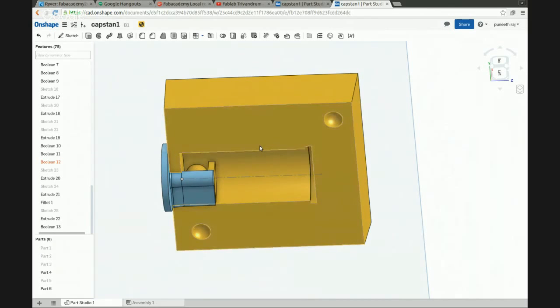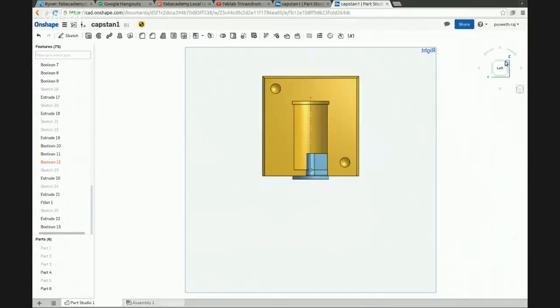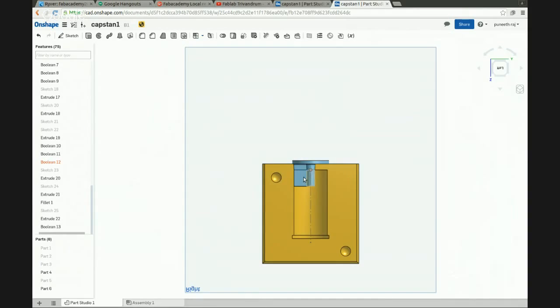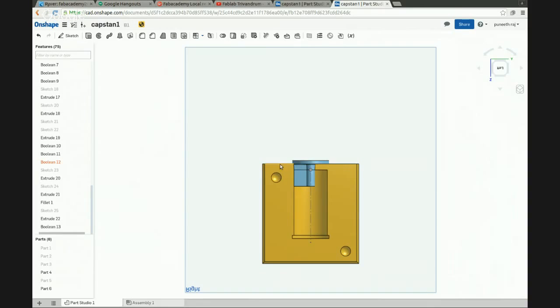So this is the first part. The other half is the second part. This is the third part. So once I fill the resin till here, I will cap it using this. You fill it without the cap? Yeah, I fill it without the cap initially, and then I put this cap. And the remaining liquid plastic, where is it going to go? It's going to come out and create a flash over here, which is fine. It will be a very thin flash.